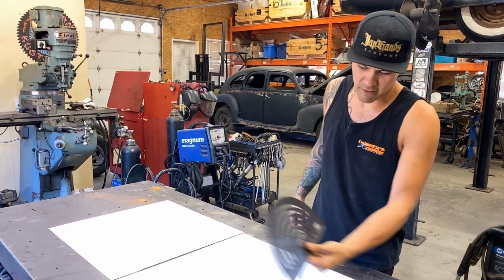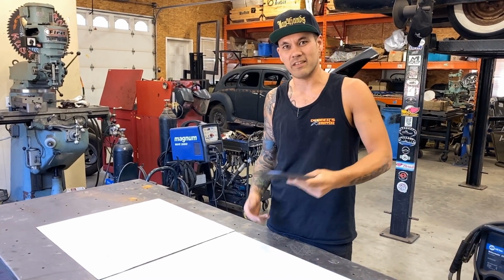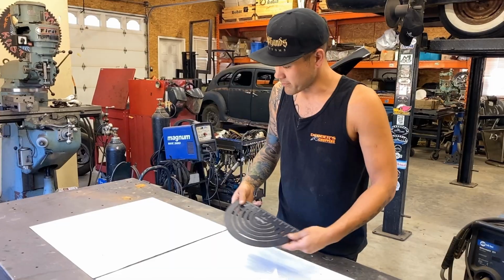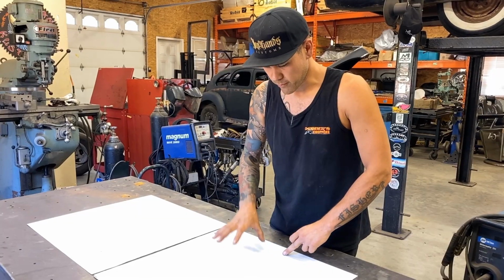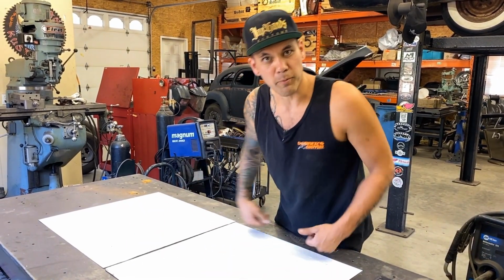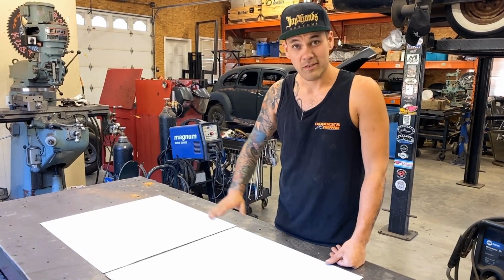This is a layout tool. It's a Mittler Brothers Jamie Jordan series. I got a little set from a friend. So I like to use them for my radiuses, and they also work great for the scales. So I'm gonna lay out a border first on both panels. I'll probably do a larger lower portion for my diamond and scale pattern, and then just a stepped upper portion to kind of make it look like how I do most of my door handles. So let's get started.